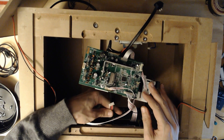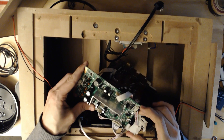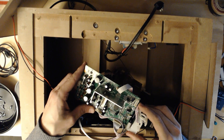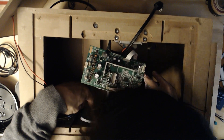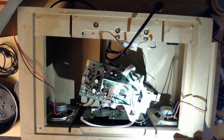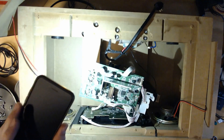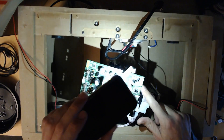There was an iPod pin going in, and I noticed this pin — black and red usually mean power; red is out, black is ground. That gave me good hope. I found a nice little note on there that did say 'iPod power plus five volts and ground,' which is exactly what I wanted. I looked even deeper in and found where the connector went to the display board — that was all the inputs and outputs. If I want later to hack into that and have the Echo output song data to the display, that would be how to do it. But for now that goes well beyond scope, so my focus is going to be on figuring out the pinout for that USB connection.